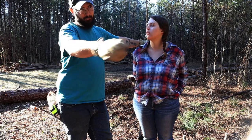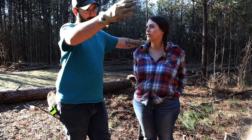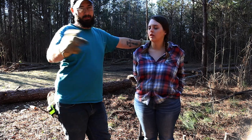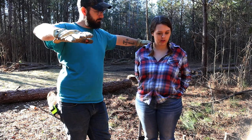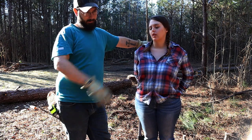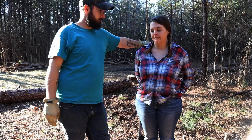But I would dig all your posts out and then get everything level, tie in the top parts. What do you mean tie in? Like you're bracing everything for your roof. Okay, gotcha. And then dig out around. That way your posts are there. But the post is going to have to be level across the top.